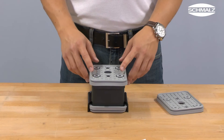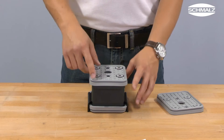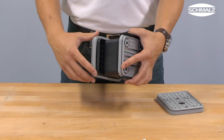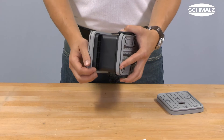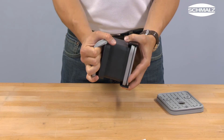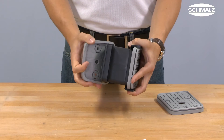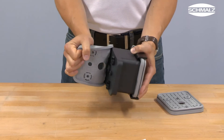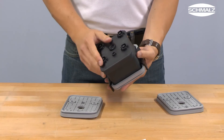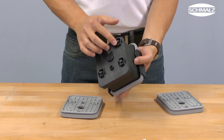First of all, you need to remove the damaged suction plate. The least resistance to withdrawal offers the edges of the suction block, right here. Pull the suction plate over this edge. It can be removed completely from the vacuum block in one stroke afterwards. A short follow-up at the domes might be necessary.